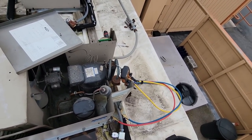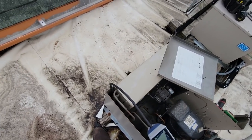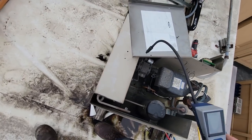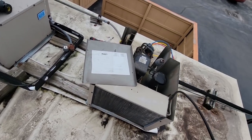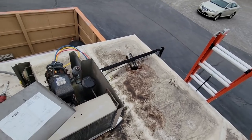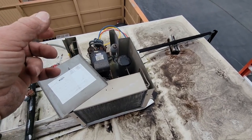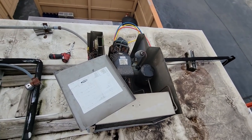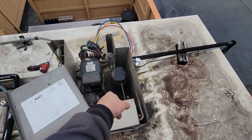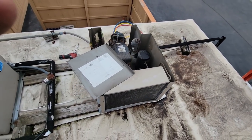Pressure's not real high. I opened up the valves and only got 50 pounds on each side. Let's go inside. I don't like what I'm seeing - fan running continuously with no low ambient kit on it, that's going to cause it to be naturally low. This is really annoying because people don't clean up their messes. Maybe that's a compressor change-out or something that caused it - who knows.